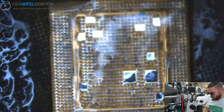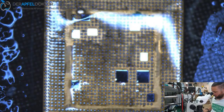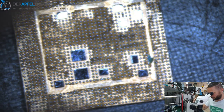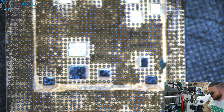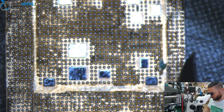Under the microscope, the CPU seems to be a little bit ugly because of this black glue between the pads. I clean the A11 always in this way. A little bit of this black glue you still see after the cleaning, but all the pads are safe and it's only the bottom. Here I lost some of the surface, but just a little. I just covered it with UV.